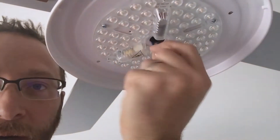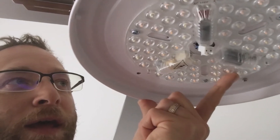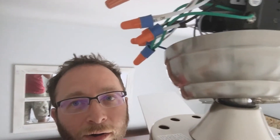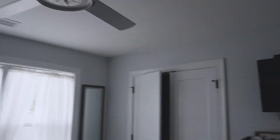For the light on the bottom there's a little power connector that pulls down and connects to the power side, nice and easy. The four screws we took out earlier will hold it up to the base unit — don't put too much pressure on it as this part has some movement and you don't want to bend it. I like to do electrical tape around the wire connections, especially where the braided fan wires meet the harder 12-gauge wires. Even though they're in wire nuts, I still tape them so they're not going anywhere — totally up to you.